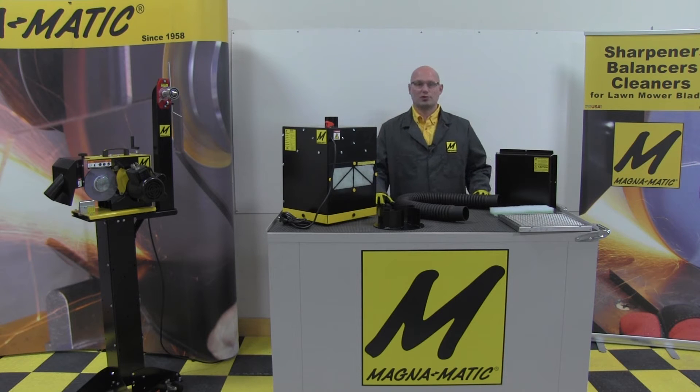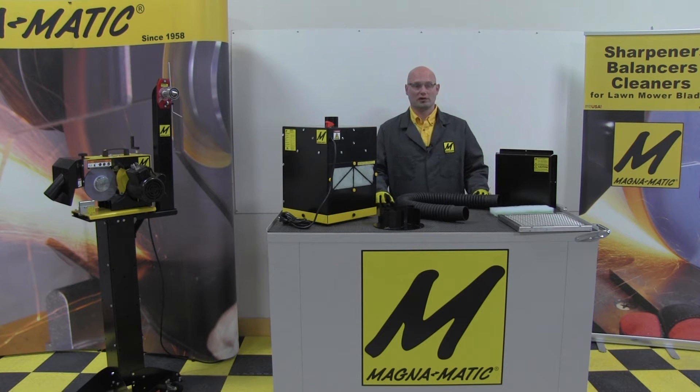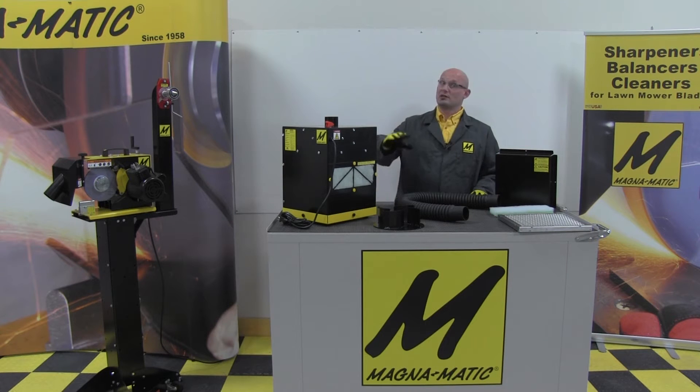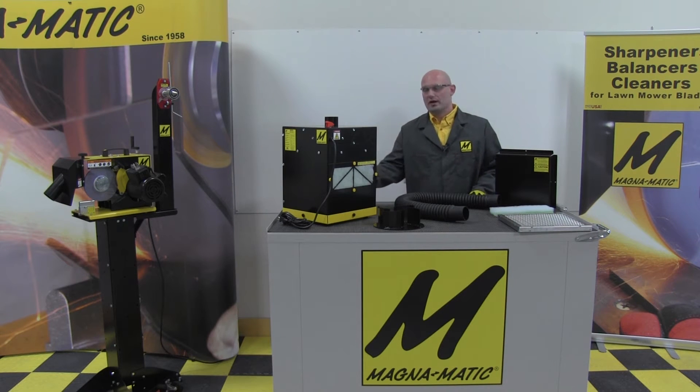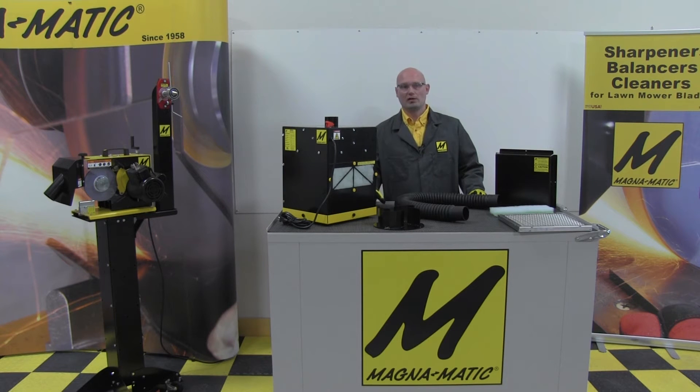There are of course products in the industry that already exist like this. So why did we make our own and design it in a certain fashion? The industrial side of dust collectors, or sometimes called air cleaners, is that they are usually quite large or very specific for certain machines, and in the end really just very expensive — many times costing a lot more than our sharpeners do. The other side from a cost perspective is the shop vac, which does function, but it's very weak on its filtration of the air. The filters in shop vacs are really not designed to take care of very, very fine particulate.